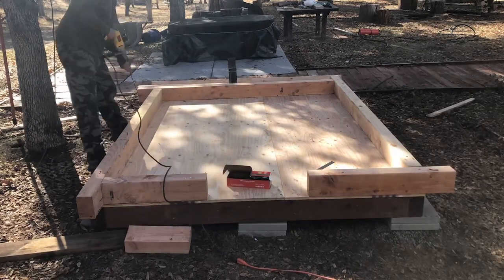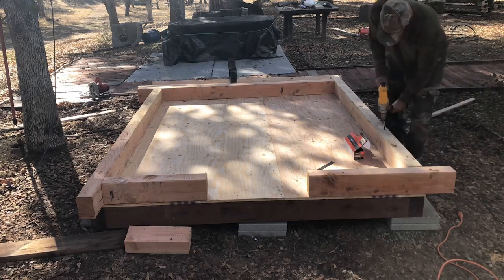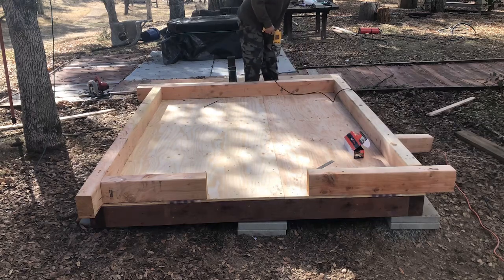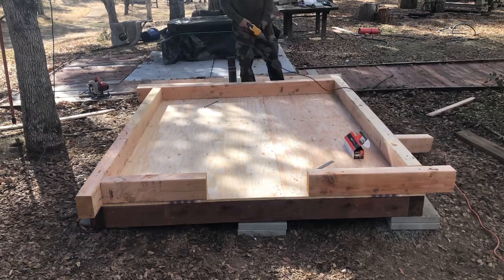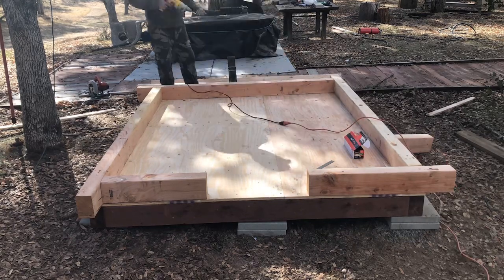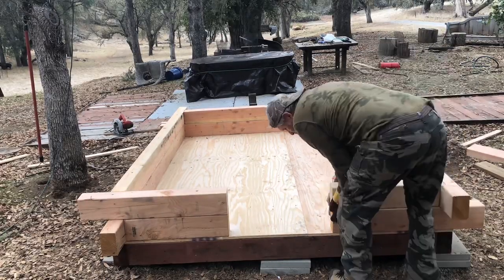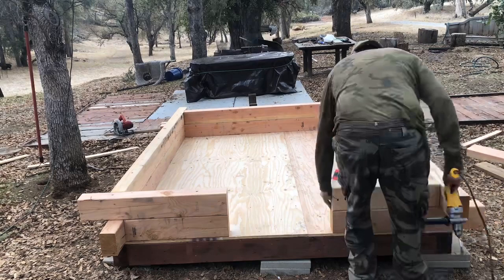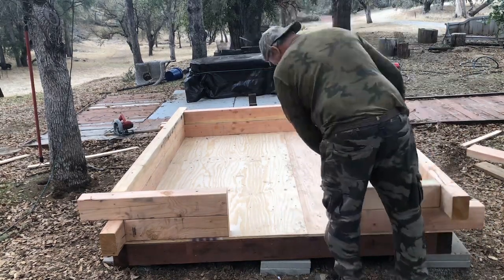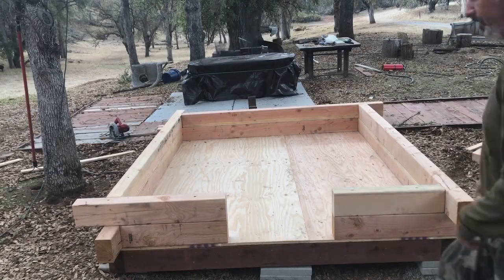And as you can see with the butt-and-pass, you have them extend out about 6 inches and then butt up against it. And when you do it this way, it's really interesting. So I'm using 10-inch long screws to hold them in place. And then you just keep doing that. I do 4 for the foundation, and then 3 as the build goes. Each piece gets 3 screws. The smaller ones get 2 screws. And it's coming out really good. I'm very happy with it.